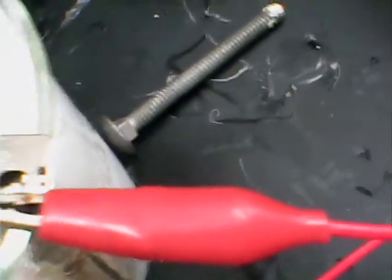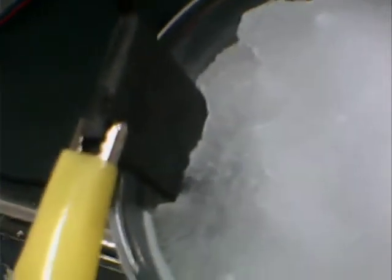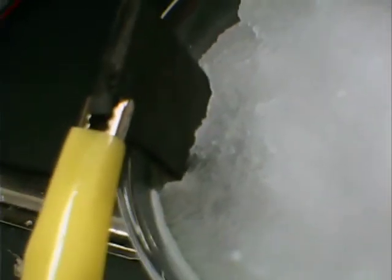For the one cell alone — the magnesium-graphite cell — I was getting initially an open circuit voltage of about 2.8 volts, and drawing initially about 25 milliamps short circuit. I have it hooked up in series with an AA battery, so I have them both together. I am interested in the internal resistance of these gel electrolytes.